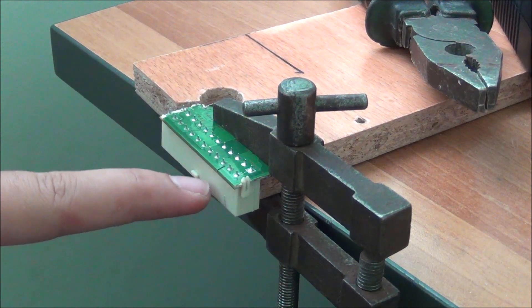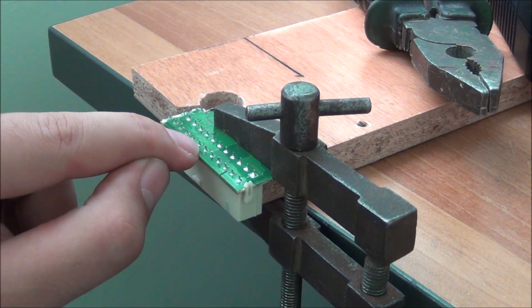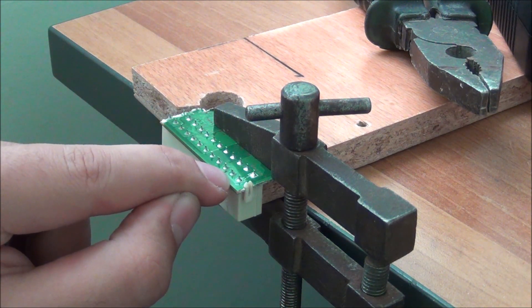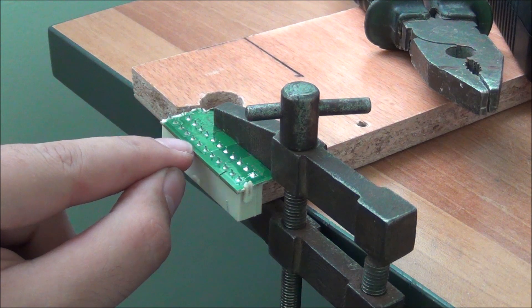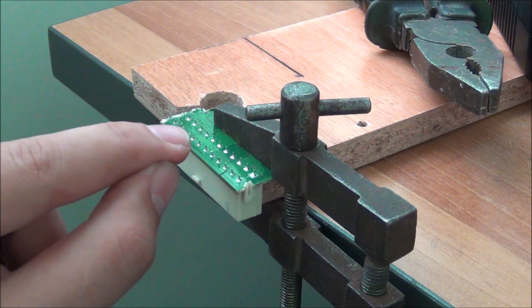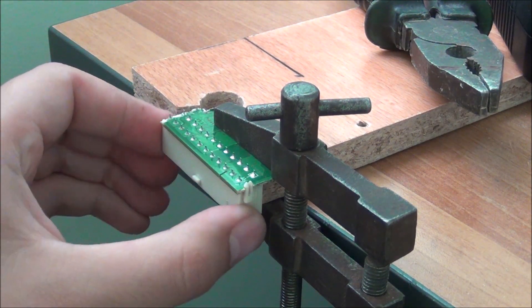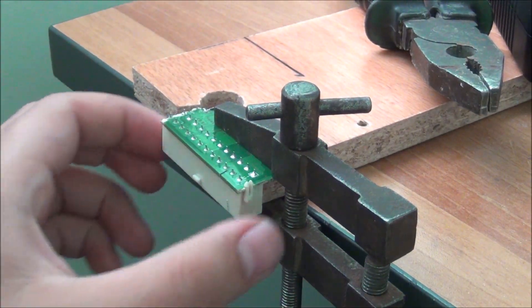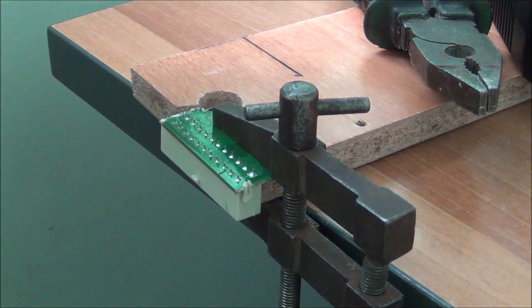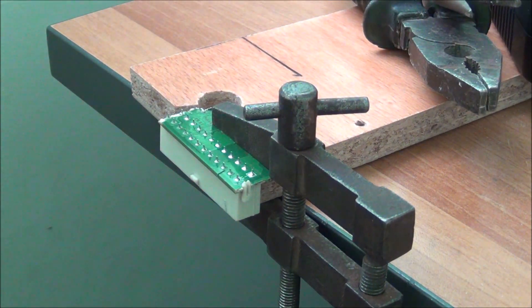At this point I had several attempts at cutting this connector to the required dimension, because most likely it has shorted pins on the back since many wires brought the same voltage to certain areas — but I won't need those shorted pins. In the end the only way was to clamp it in place on a particle board, use a hot air gun, and take it out with tools — most likely off video because this thing makes a lot of noise.